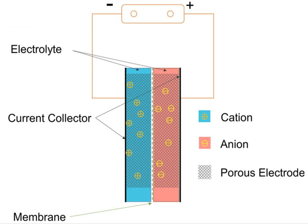The electrodes are kept apart by an ion-permeable membrane separator used as an insulator to protect the electrodes against short circuits. This construction is subsequently rolled or folded into a cylindrical or rectangular shape and can be stacked in an aluminum can or an adaptable rectangular housing. Then the cell is impregnated with a liquid or viscous electrolyte of organic or aqueous type. The electrolyte, an ionic conductor, enters the pores of the electrodes and serves as the conductive connection between the electrodes across the separator. Finally, the housing is hermetically sealed to ensure stable behavior over the specified lifetime.